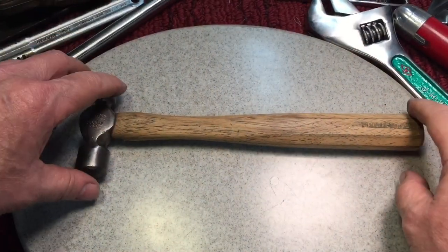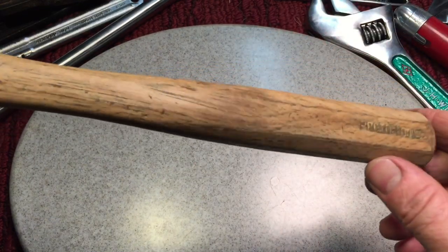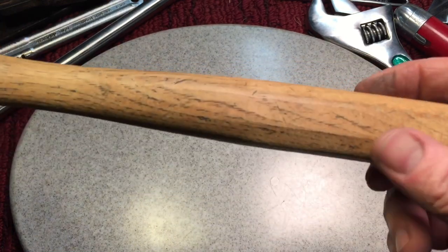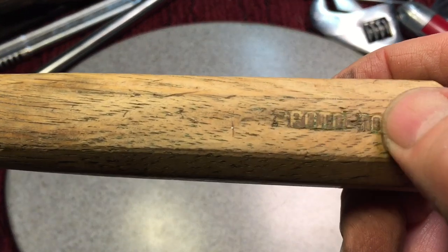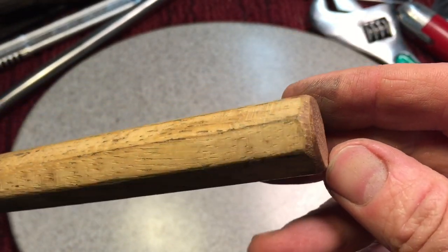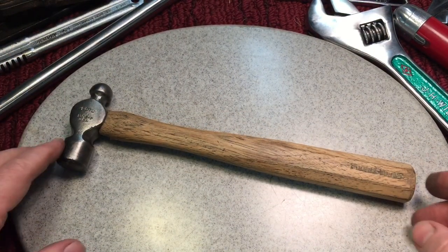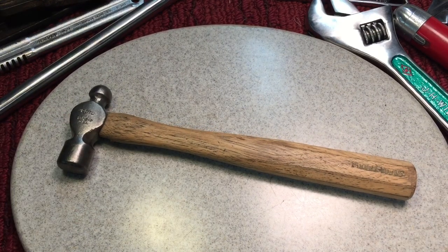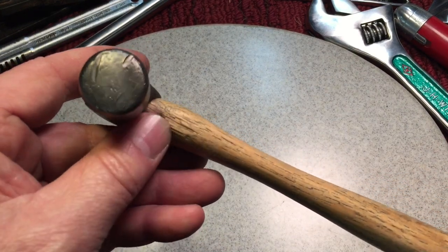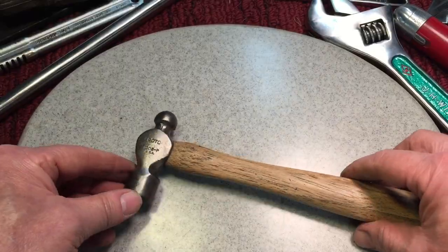Okay, 15 minutes with the straight edge razor blade. You can see the sheen on there — scraping is such a superior way to finish wood. You could put a finish on right after scraping, it's smooth and nice, but we'll do an additional sanding especially because scraping might screw up the letters here. You can see how we chamfered that back edge, and you see how important that is. Doesn't that hammer look a little bit more balanced now? We only took off about an inch and a half, but it definitely looks more balanced and is very comfortable in the hand. It's a beautiful hammer. Before we do any serious finishing, we're going to address all this, but first we're going to clean up the head, polish that up.